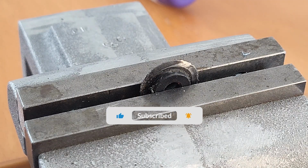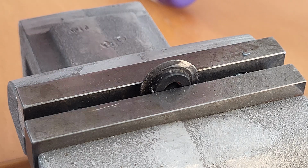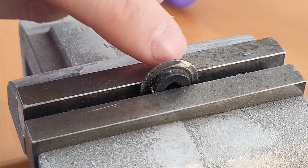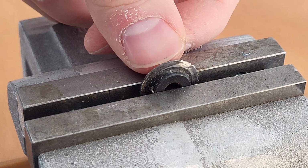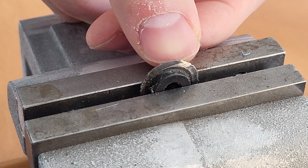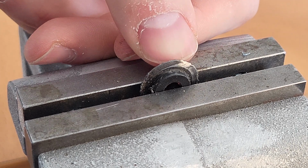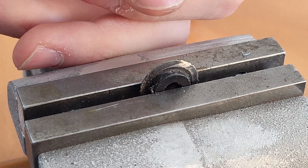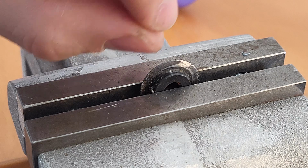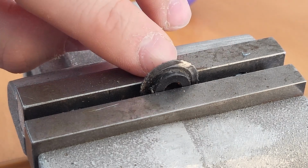When you're sharpening and you're going all the way around the blade, try to keep your grind very even. The issue is when you cut something that's very hard like glass, only the top parts will actually score the glass, and everywhere where there's a surface defect it just won't. Now repairing larger nicks is gonna be too difficult. I think there's really no way, without using a lathe, to get this super even. So try to get it as good as possible, but don't sharpen one patch too much.